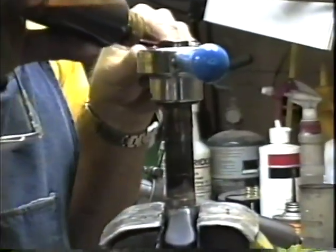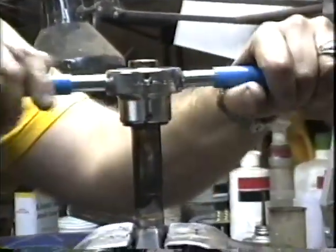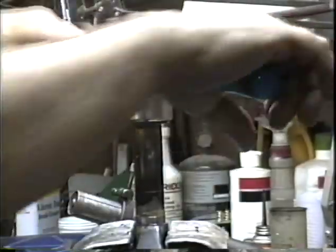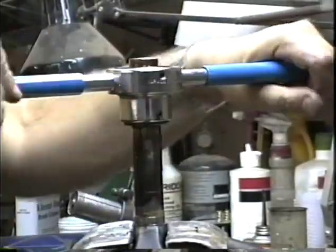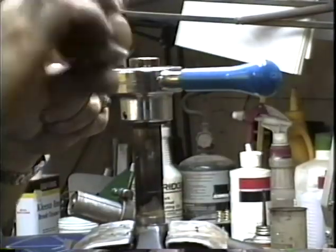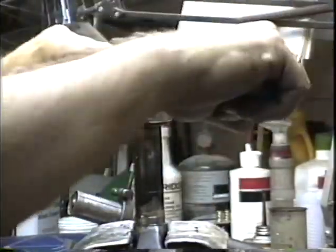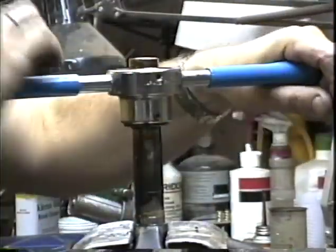The really important reason for backing the cutter up is because when you're cutting these teeth, these threads, the very, very front of the cut is like a little furrow, and it's like running a plow down a farmer's field. And when you back up, it allows the cutting oil to flow right into the forward portion of your cut. If you continue to go in one direction and you don't back up, you're going to have a hard time getting lubrication down there for cooling purposes. So, do a lot of backing up.